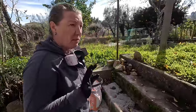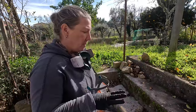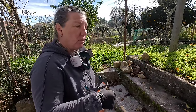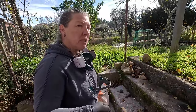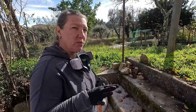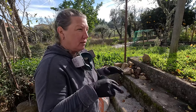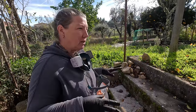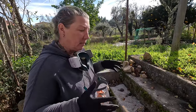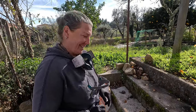So we'll see how we go. I like the idea of fewer coats and therefore taking less time, because we've got lots of other stuff to do. I have read many things about this and watched a couple of videos, and the general concept is you put some water in a bucket, you then sprinkle in your quicklime and stir it, and keep slowly adding and waiting and stirring, and eventually a whoosh happens. A whoosh is a little bit like if you're making a white sauce or a bechamel sauce on the stove — you add your thickener and stir, and then all of a sudden it starts getting really thick. It's going to slowly heat up and then all of a sudden, whoosh, and that's when it's ready to go on the walls.